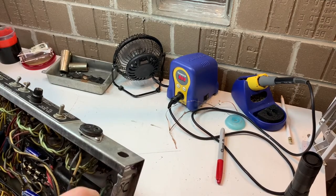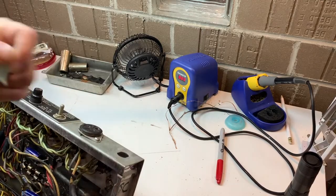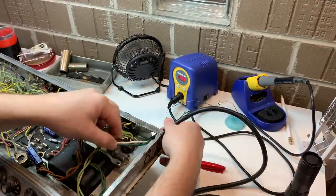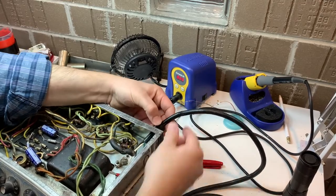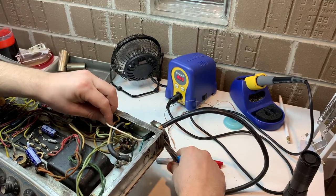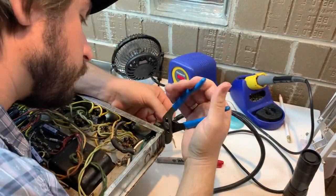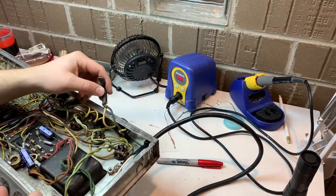Typically, any sort of generic, like a HOSA IEC cable is usually a great size to replace on a Fender amp. But in this case, I have plenty of power cords lying around from God knows what. So I'm just going to grab one I've got that is the right gauge. Put the old cable stay on it. Give it a little squeeze of my channel lock so that it makes an impression in the vinyl on the outside of that cable, so we can get it into the chassis.